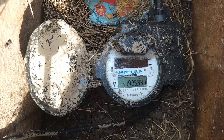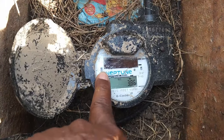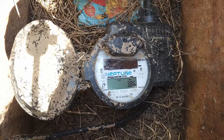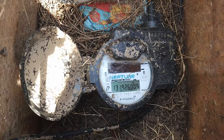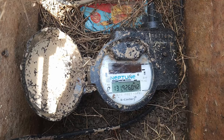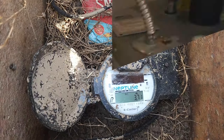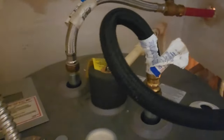Normally you have a digital meter, or you have a manual meter that has a small leak dial on it and it'll constantly spin — that's the first thing you want to check. So looking at this, we know we do have a leak. The next thing you want to do is listen out for any water running. First place to check is over by the hot water tank, and you can definitely hear the water is constantly running.